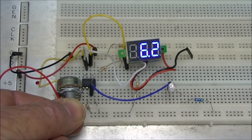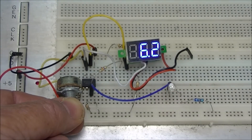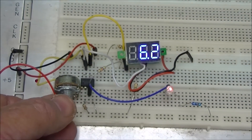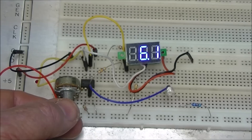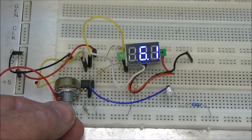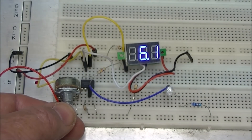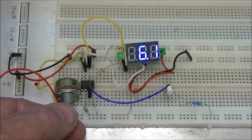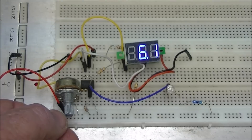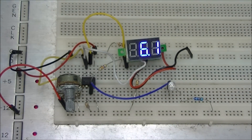Here it's barely on — it's sort of fluttering a little bit. This is a problem that you suffer without hysteresis. You can see that it blinks on and off and is really sensitive right around that voltage. If you have something like a really slow-moving signal, such as from a photocell-resistor combination measuring the intensity of the sun, that could create problems if you're trying to trip a relay or turn on a motor.